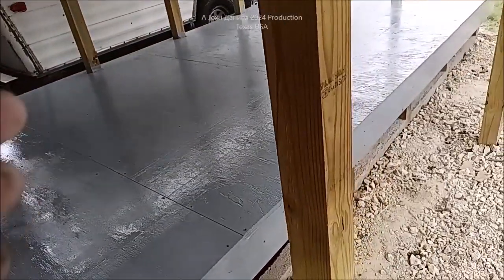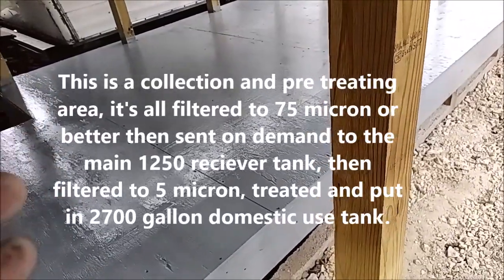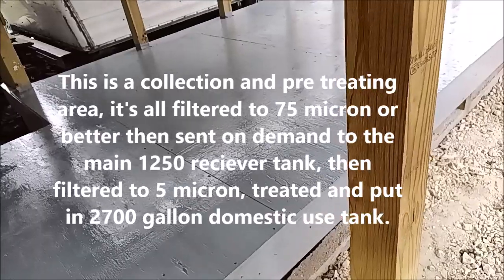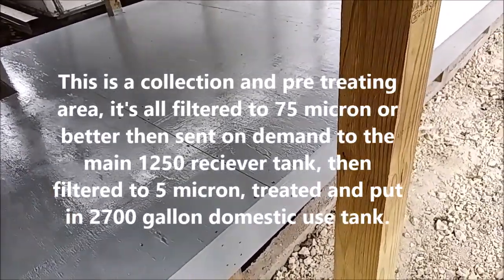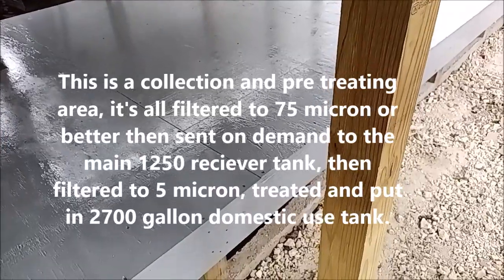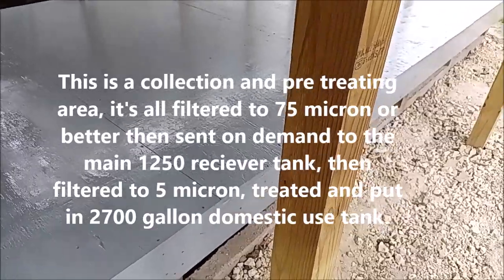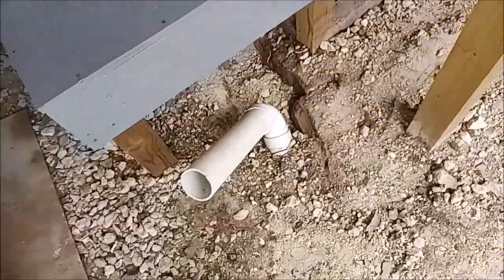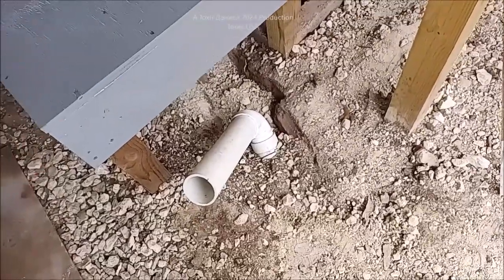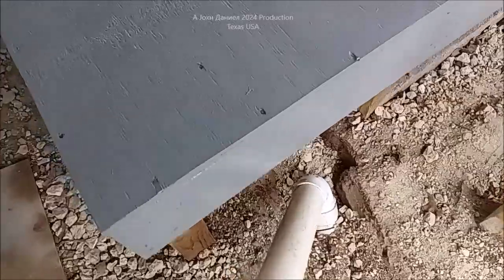With four of those IBCs it's only going to be about 1100 gallons. Our main storage tank is 4600 gallons, then we have another 1250 gallon tank in the back that catches the other half of the building, and another pair of 275 tanks that are going to be catching the north side of the building. We've got them all piped with pipes already down in the ground.